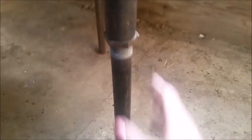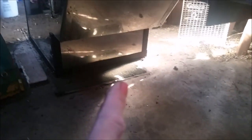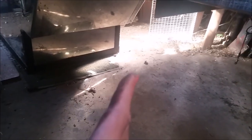You can pay to have this brick pre-built wherever you buy it, but I read it adds about a thousand to eleven hundred pounds to a two-by-six, which this is — making delivery and setup really hard. These legs are adjustable because once you get this set up wherever you're cooking your maple syrup, you have to build a cinder block foundation or platform for it to set on — that becomes your ash pit. They recommend raising it five to twelve inches to be able to collect and clean out ashes.